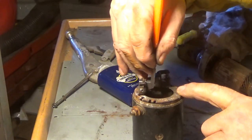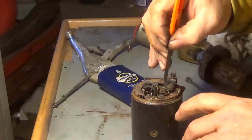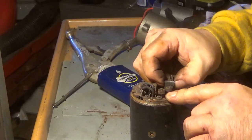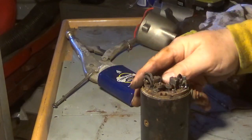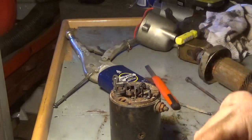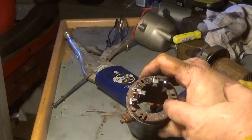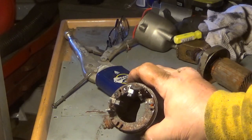I have the brush pushed out and I'm just going to carefully scrape it. Now it moves — not great, but just bring it back and forth. That guy moves well — it moves the way it should. I'm going to work on the other one a little more and then put it together again. Now they're both moving as they should. If they're not moving properly, you don't put any power to the armature and things don't turn round.